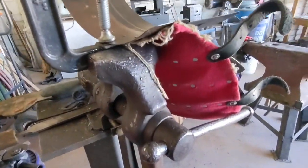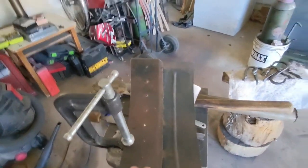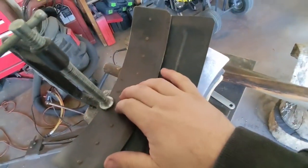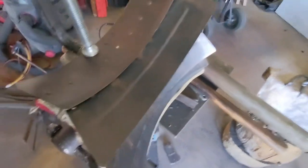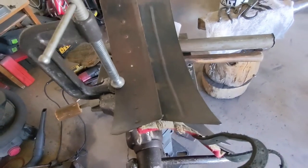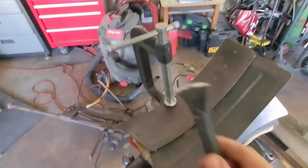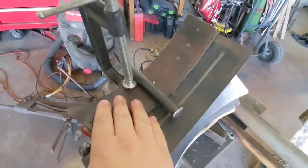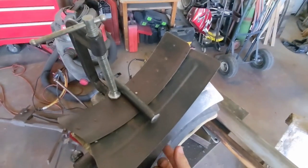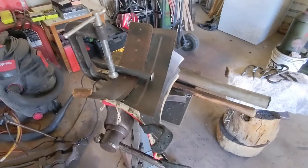In this case, I have just a big old C-clamp clamped up in my vise. You may or may not have a post vise — this is better for beating on stuff — but for what we're doing today you can really just use pretty much any old bench vise, and then I like to use a little C-clamp to get the piece in here nice and solid so it's not going anywhere. Once I've got that clamped up, I take my hammer, get my chisel, and I also have a punch to drive the rivet out — but we'll get to that in a minute. So this is my setup: C-clamp, vise, piece of armor. Clamp the piece you want to chop the rivets off, and I'll give you a more detailed technique in a moment.